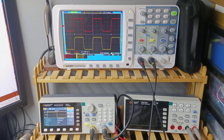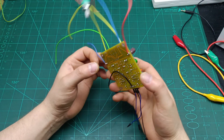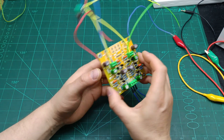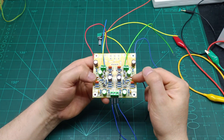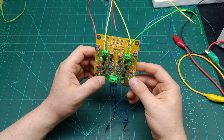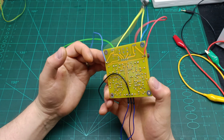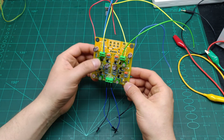I'm really impressed with this pre-amplifier. Maybe now it's time to look for some film capacitors to replace the 5.6nF ceramic capacitors, because this pre-amplifier is definitely promising. It's small but it's performing really well. I'm going to look for film capacitors instead of the ceramics and if I find some I'll definitely swap them in. Let me know in the comments below what you think about this pre-amplifier.